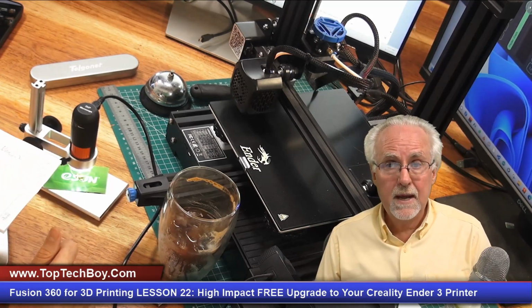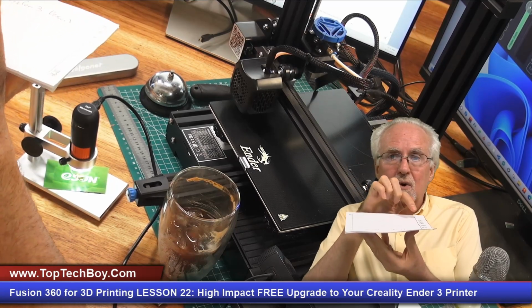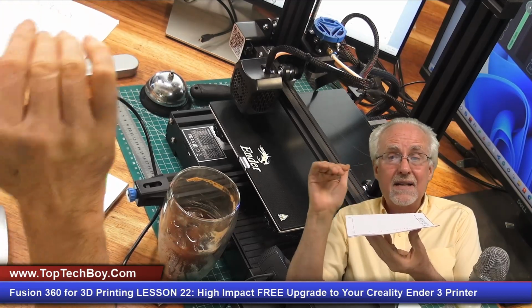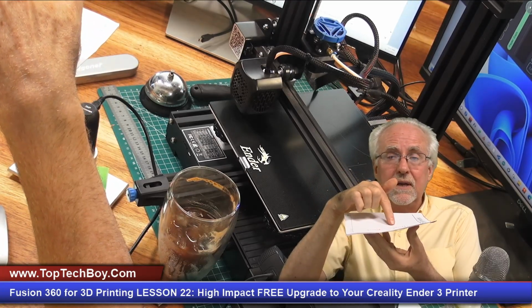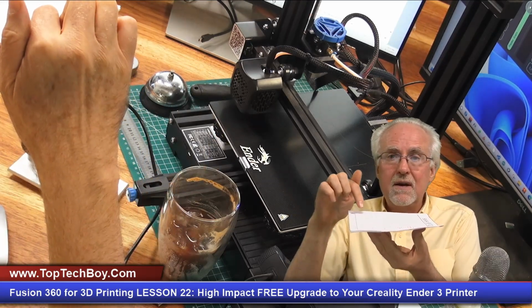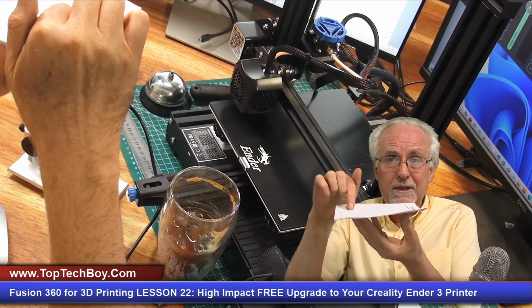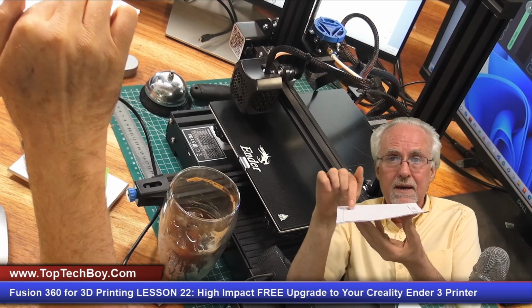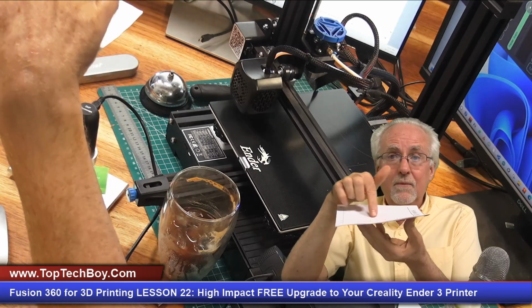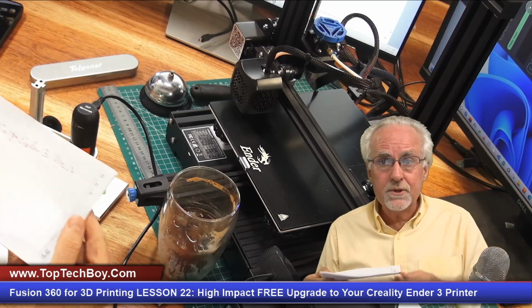Now, how we sometimes compensate for that is when we do the bed alignment, we align it here, here, here, and here, and that's aligned perfectly. But then if we go look in the middle, the gap is too big in the middle. So how do we compensate? We bring the bed up where it's much too close here, actually probably dragging, the tip is touching the bed here, touching the bed here, touching the bed here, and then when we print in the middle, it's about right. Now, what's the problem with that?